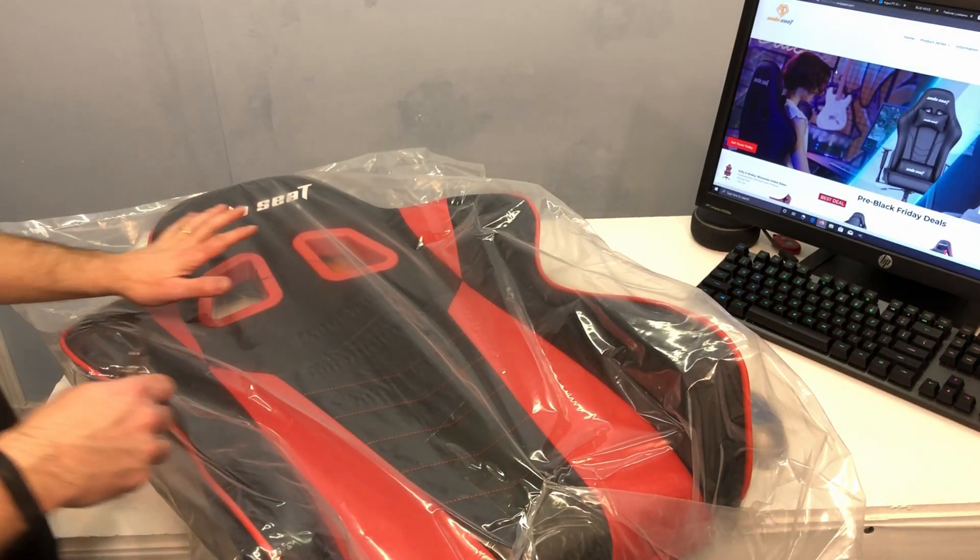Here's the seat base and this is a cast aluminum base — I've seen where these can actually be cast iron, but this is a die cast aluminum base, painted sort of a matte black. Something else to point out is all these socket head cap screws are all metric and they are M8. And the underside of the seat really does look nice the way they've pulled the material around and tucked it all evenly with little hog ring clips. They've done a nice job keeping it neat, it doesn't look sloppy or like an afterthought at all.